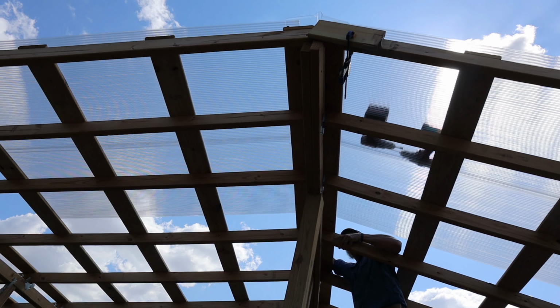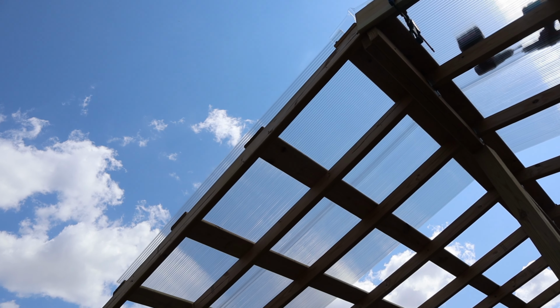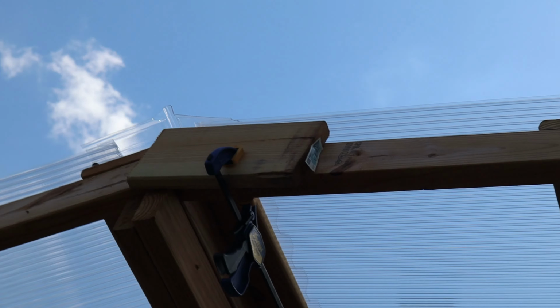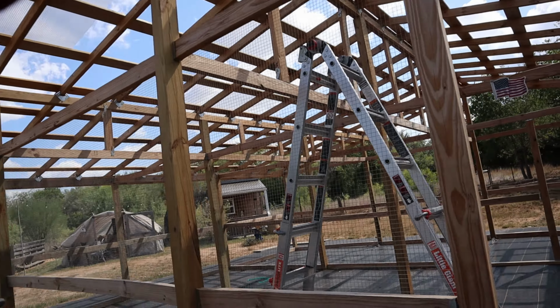It'll rinse off. And he has it all nice and lined up on the outside right here so that there's room for the fascia board. It'll go out over the fascia board. And then we can put an L trim on top, like that. And right now he's putting on the peak, the ridge cap. So we're doing that in sections, because as you go down, you're not going to be able to reach it. So I'll go up top and show you what that looks like.